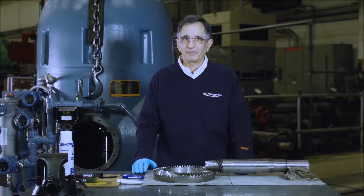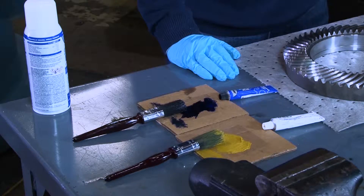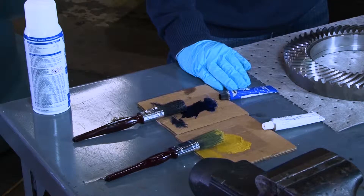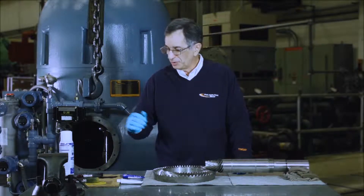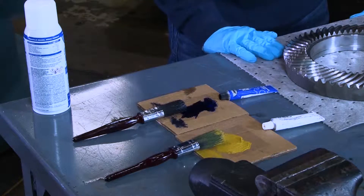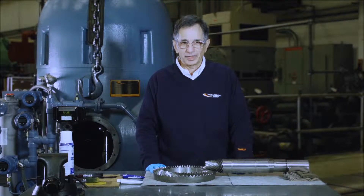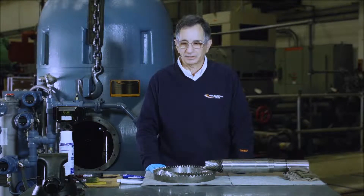The next step is to have the proper tools of the trade. For your initial tooth contact check, you need a Prussian blue compound. You need a gear marking compound, which can be found online by searching under that term. You need two paint brushes. And finally, when you're done with your initial check, you need some layout blue where you clean off the gears and put a layer of the layout blue on. That allows you to look at your loaded tooth contact pattern at the time of next outage.